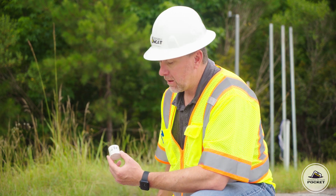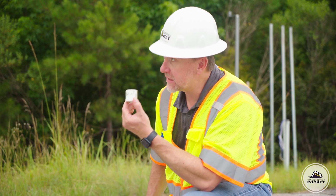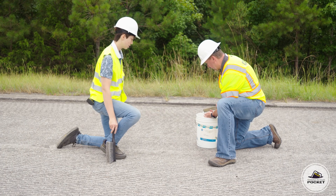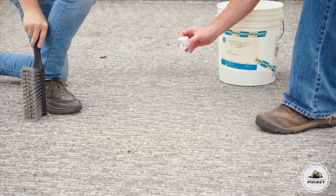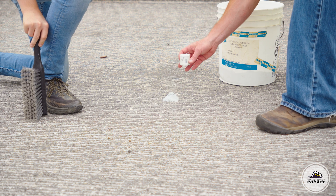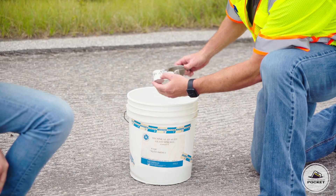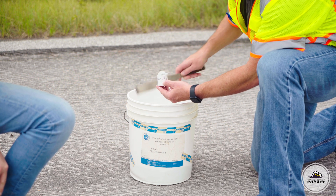What's the number written on the side? That number is 1.684 inches cubed, and that represents the volume in this cylinder. I'll fill the container with the scoop, then strike off the top so we know that's the actual volume. I'm going to pour it on the surface in the middle of that cleaned area and make a tight cone so that it all sticks together. I can tell this is a pretty aggressively milled surface, so I'm going to use two volumes worth of this material — we need to remember that in the calculations.